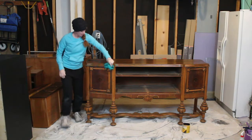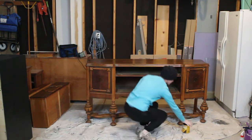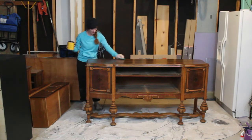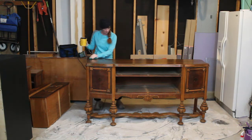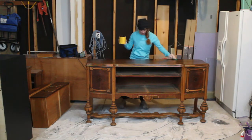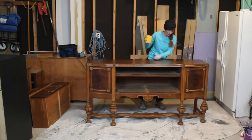I'm actually not a huge fan of this color right now — I want it to be a little bit darker, so I'm going to apply a second coat of the gel stain, putting it on a little bit thicker. If you put it on really thin and just rub it in, it's honestly not going to change that much. I think that was my problem — I haven't used gel stain in a while and I forgot that you need to leave it on. You just want it to be an actual coat that you can see sitting there; that is going to turn out a lot better.